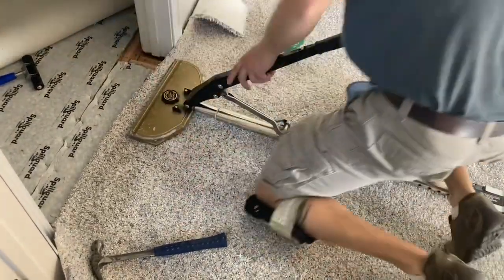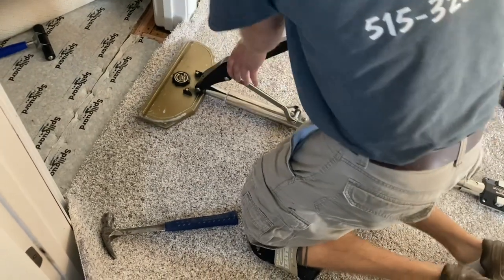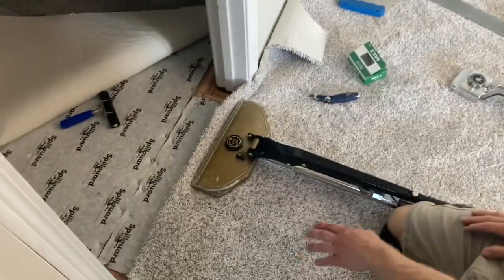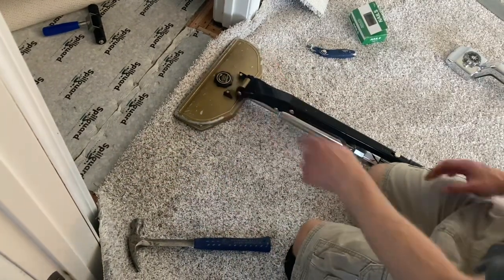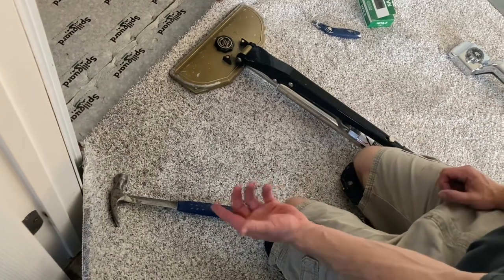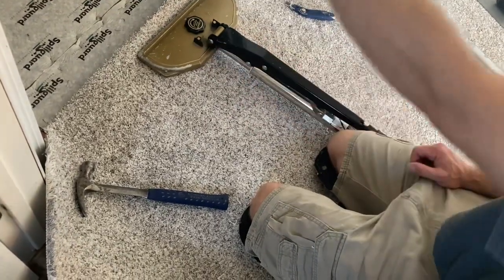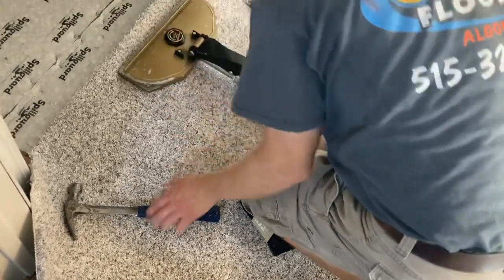I'm going to do a little relief cut and then a little more stretching. So if done correctly, once I let this stretch up, we're probably going to see a little pucker right here, right on this side of the nails. And that is the tension coming back. This is going to stay stretched. This is just going to have a little pucker on it. Not a big deal because we'll leave those nails in there, put our seam together. Once I put the board in there and stretch that way, boom, stretches that even. Puckers are gone.